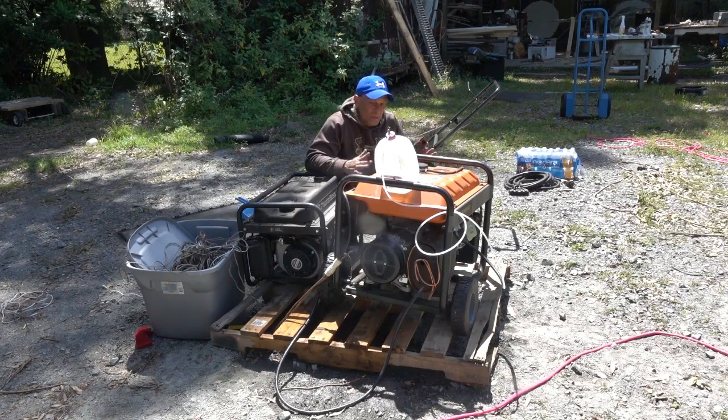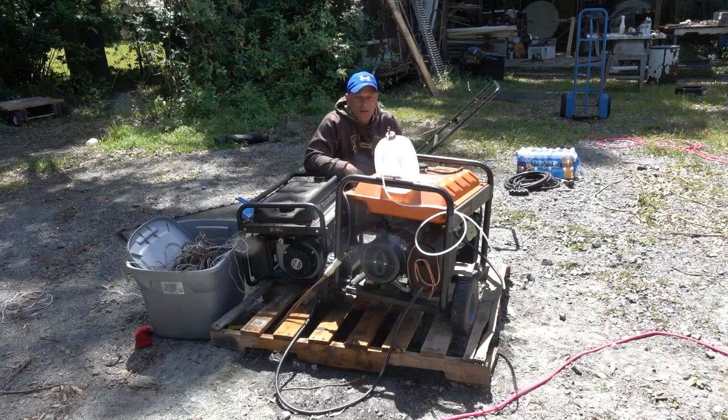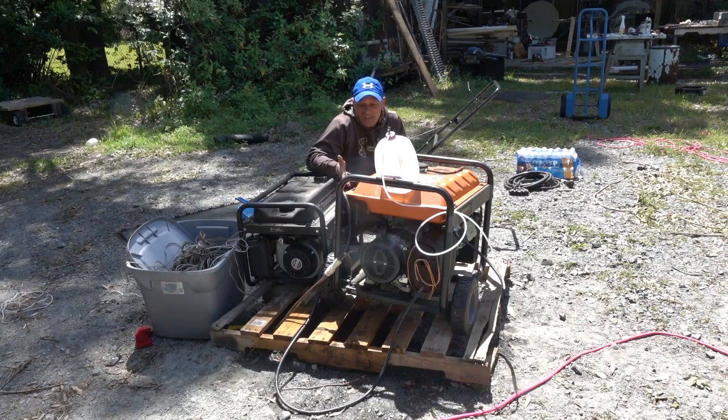That's the test for today. I'm going to be doing the complete setup — maybe taking that off and wrapping it really good since we know it works. See what we get with that, because even with that water around there the muffler was still 400-and-some degrees Fahrenheit, so it wasn't pulling hardly anything off of it or blocking it. So that simple system would work to just warm water. This is part three of the series we're going to be doing on heat exchangers and ways that you can get water into a water heating tank or whatever you make.